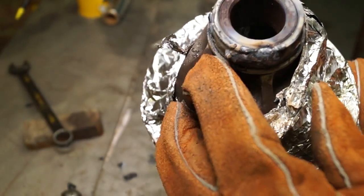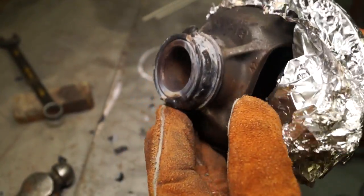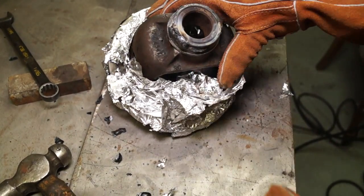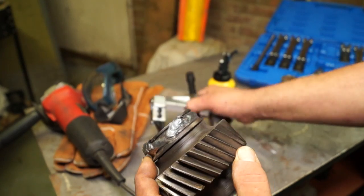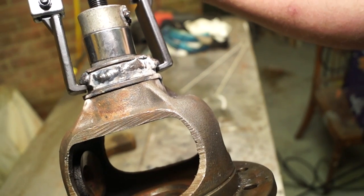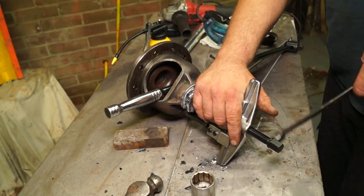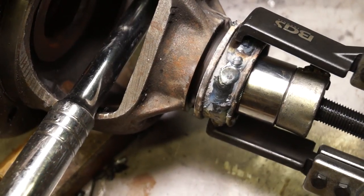I've run a weld all the way around and then put two tags on it. What we'll do from there — you can see it's steaming hot — is cut some slots in it with a grinder. I'm not going to show you that with the grinder because of sparks on the lens, but just take it from me — use a grinding disc and make sure you cut some square flats so we can pull on two sides. You could do this evenly for a three-legged puller. This one will come off with a two-legged puller. You can see where the grinder has been and where the leg will now fit in and grip — this is what we're after. I've made myself a setup with a socket that fits and a security wheel nut, using a bar to push against so that's on the bench. Just use a puller and wind it off — I'm demonstrating that the puller will actually pull. You can see that — easy.